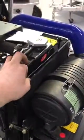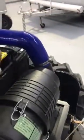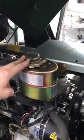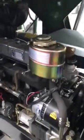You have a screen in front of the radiator when you're slashing. You do need to take the hose off to get the screen out because of the design — just how it is. Power steering bottle over here, with a dipstick on the bottom of the thread of the bottle. Two fan belts and a solid-state fan.